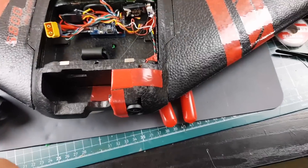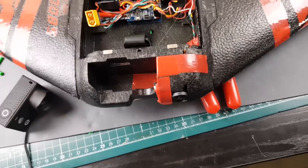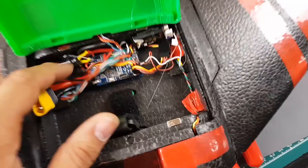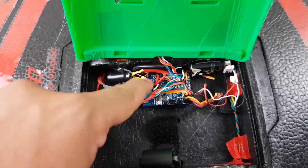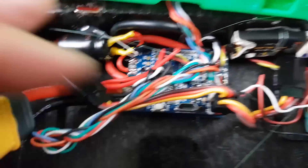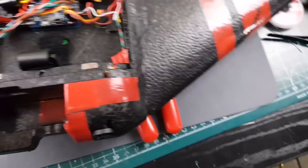I did have a couple of fail-safes, but I'm giving it the benefit of the doubt under two conditions: one, I only have one antenna, but that shouldn't be a real issue; two, it wasn't as clean as this when I first took it out for a maiden — I came back and cleaned it up. I also added a 1000 microfarad Panasonic low-ESR capacitor. This flight controller has two ESC outputs, so I just used one of them and stuck it with hot glue so it doesn't vibrate or hit the flight controller in flight.